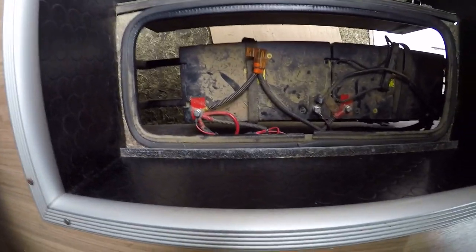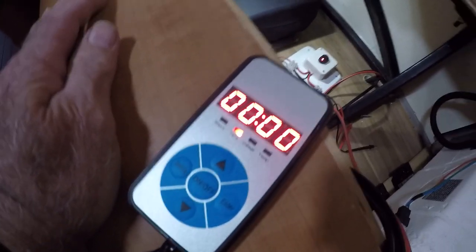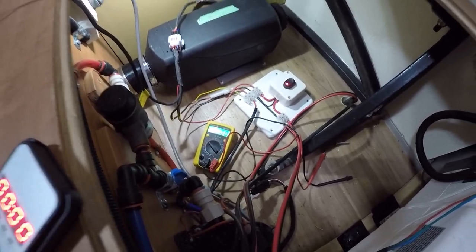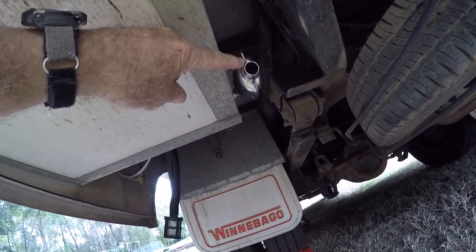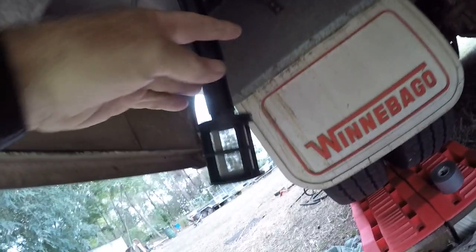I've double checked the wiring to the battery and installed the fuse. I'll turn the main switch on — we've got power to the controller. Let's start it up and see if it works. I'm checking the exhaust for smoke — it's actually running very clean on the first startup, and that's because I pumped the fuel through right up to the heater with the manual priming switch. These heaters smoke badly when they first start up if you haven't primed, because you get an imperfect burn. I haven't mounted everything up yet — I'll fix that after the test run. So far it's all looking good.